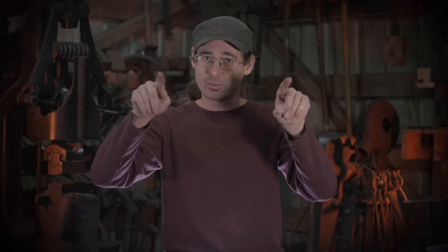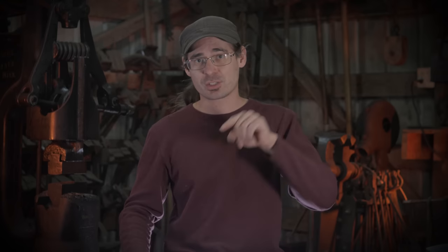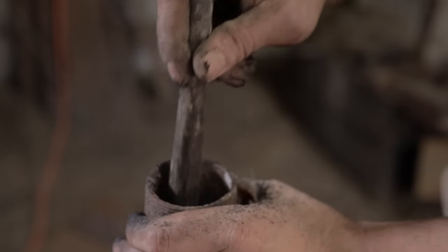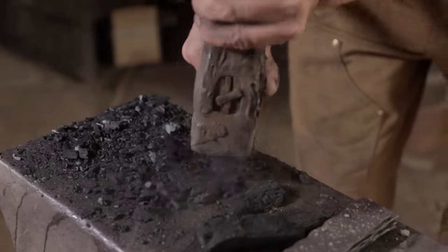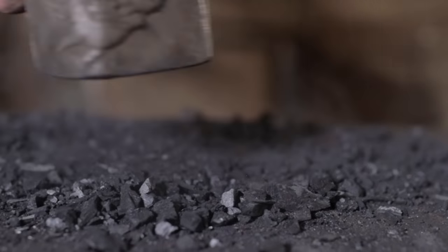So hot iron absorbs that gas and carburizes the top layer to the point where it might form cast iron. And as you pull out that bar, the surface level of cast iron is exposed to air and starts sparkling. That is, you're not burning your bar, you're doing the exact opposite. You're turning it into more steel rather than iron.